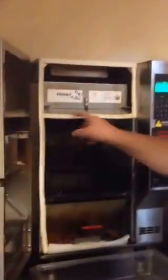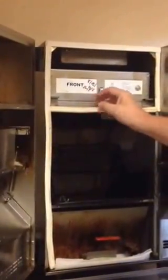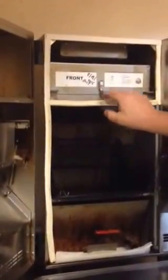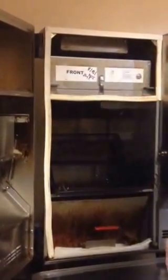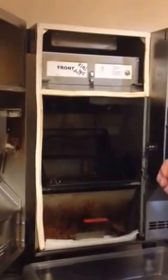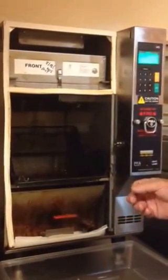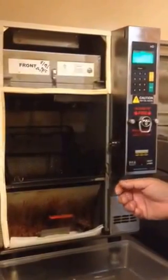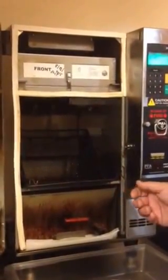You open the unit up, and the company will tell you that if you have bad seals, this tends to happen more often because the grease bypasses through the machine around the seals and is able to get into the fan. The grease collects on the fan and the weight of the grease doesn't allow it to start up properly. You'll especially see this if you have an air-conditioned shop and you open it up overnight with high humidity — that tends to cause this problem more frequently.